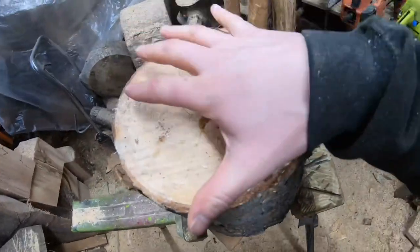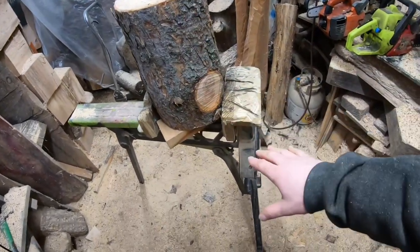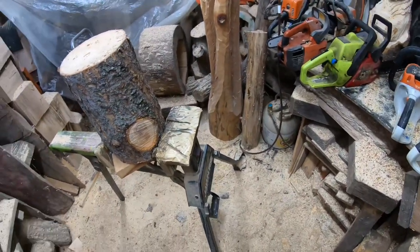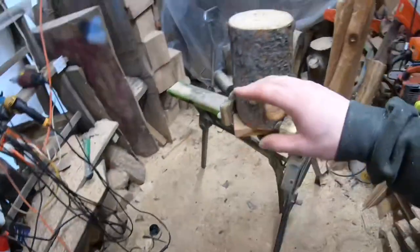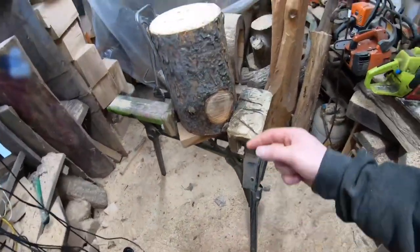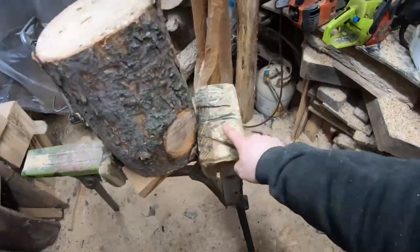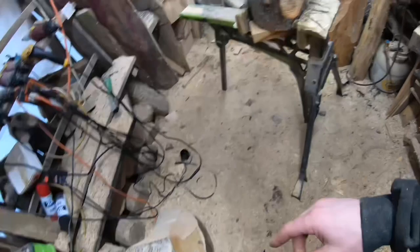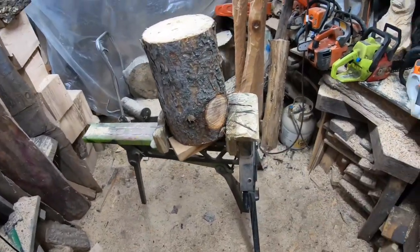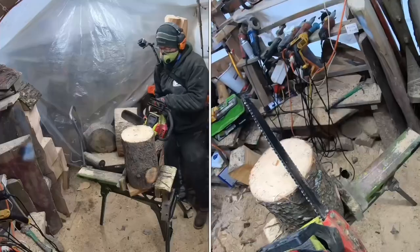We're at 15,600 subscribers — you guys are awesome, I really appreciate you. So we're going to be starting with this log right here, it's probably just under 10 inches wide and about 18 inches tall. This is a jaw horse. If you don't have a jaw horse, get yourself a tall log that's bigger around and heavier — at the height you want, screw a board to the bottom with two big screws, have that board stick out, flip the log upside down, and screw it with two screws on each side into the base log. That'll hold your piece for you.